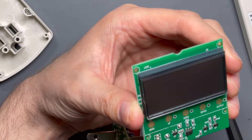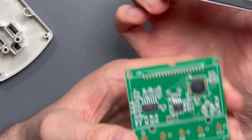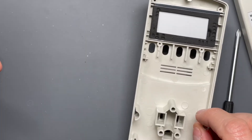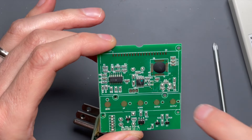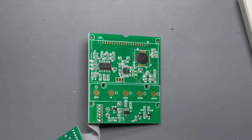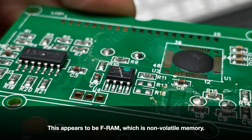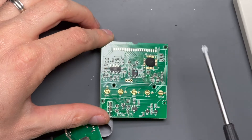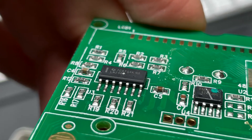I'm going to pull this display assembly off. It's a little foam pad that holds the LCD in, and then at the very top you've got the zebra strip. I'll plop that back into the enclosure so it'll work when I put this back together. The zebra strip isn't very populated — just locations for all the segments and the various indicators. It looks like there was an option for an actual packaged discrete IC, but it's just got the blob chip on there. There are some other ICs: one looks like it might be just EEPROM — maybe used for storing control functions like overload behavior and beep tones. One looks like an op-amp, which might be doing something to help with power factor determination. The analog-to-digital conversion is being done internally by the blob chip. Some voltage regulation is happening down here too. It's pretty straightforward.